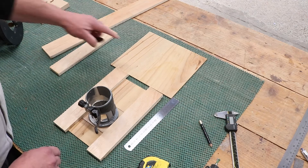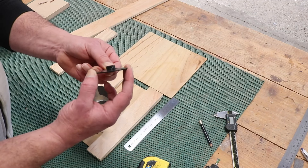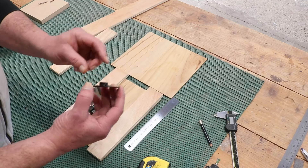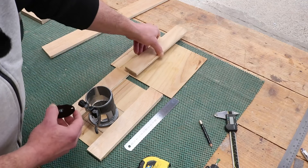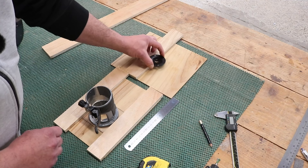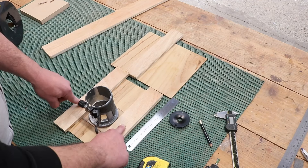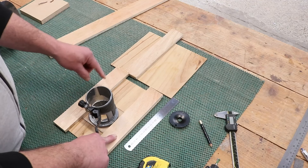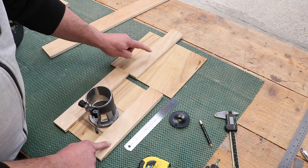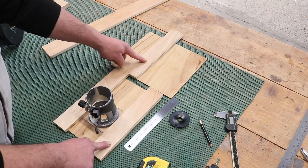When it comes to the plunge router, I'm going to be using a guide bush. The guide bush is 16mm, so the same process — I'll be putting plywood on but leaving 16mm for the guide bush to run. So what I need to do is cut two pieces of this plywood 250mm long and two pieces 90mm, and on this one I need to cut two pieces 220mm long and two pieces 16mm.